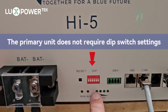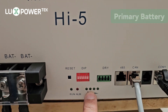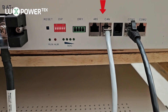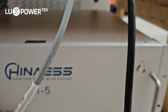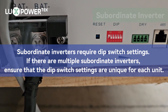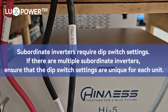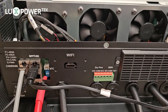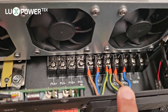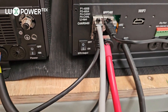This will be our master i5. You can see all the lights are off — the battery is in an off state at the moment. We've got our CAN coming in here going to the master inverter, and then from COM1 to COM2 on the slave. On the slave we've got dip number one on, and this is all in accordance with what the manual instructs.